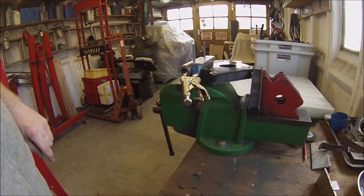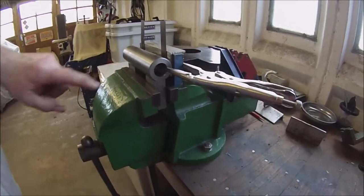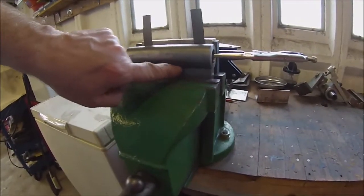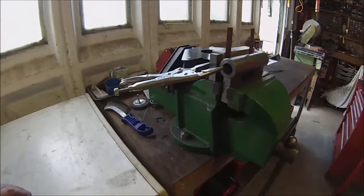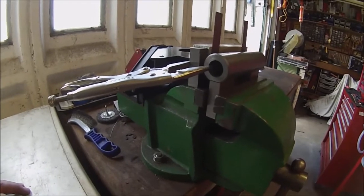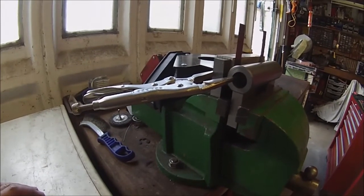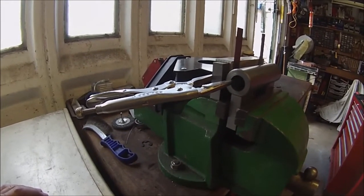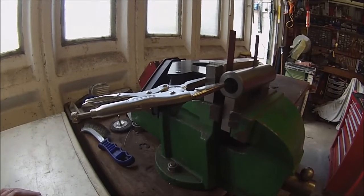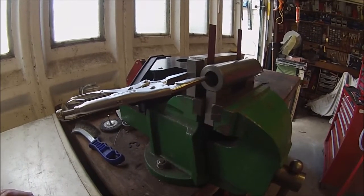I'll just move the camera around the assembly so you can see what's going on, and all I'm going to do is get a couple of weld tacks under these corners here, try and get some under there and some under there and one at this end as well. I get it tacked up into place before I finally weld it, and then when it's tacked and during welding I'll also clamp it as well, because I don't want it to distort at all, and then we'll weld it to the base part later on. So let me get the welding gear set up and we'll have a go.